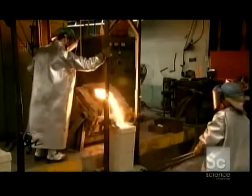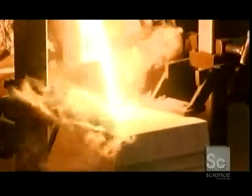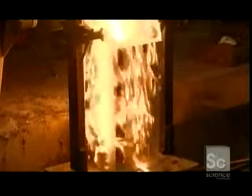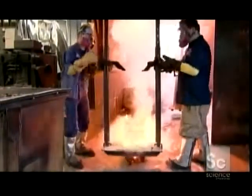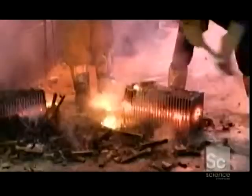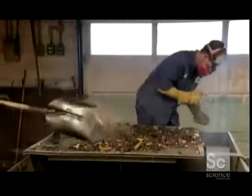The metal is poured into the molds. Because the gases that harden the sand are highly flammable, the molds burst into flames. Still ablaze, they slide to another part of the foundry where workers knock them to the floor and bust them open with sledgehammers. This lets the air in, cooling the molds and allowing the gases to burn off. All of the pieces are shoveled into a bin, and workers separate the metal from the sand chunks using — what else? — a magnet.